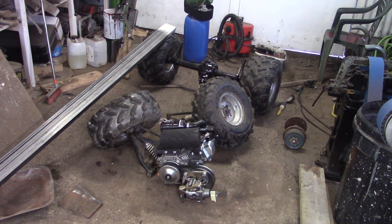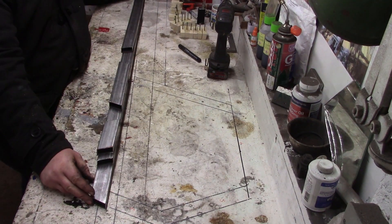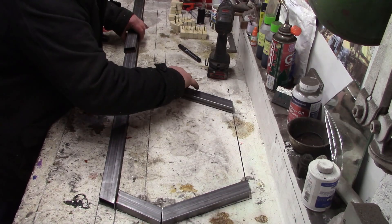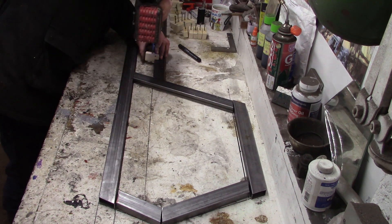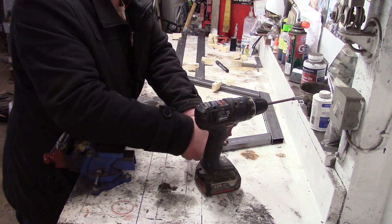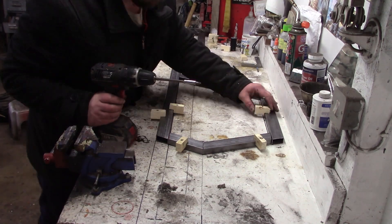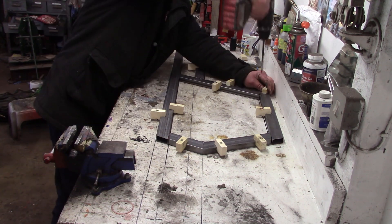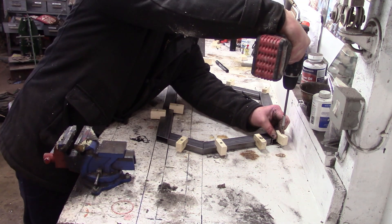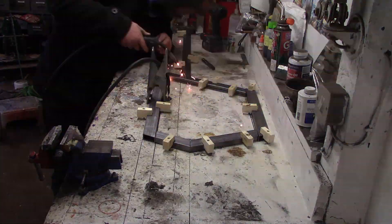Alright folks, let's build a chassis for this dump truck and join all these bits together. I've got some 40mm by 20mm electro-welded box section mild steel, 2mm wall thickness — reasonably heavy, not flimsy but not super heavy, affordable, that's the main thing. I've got everything laid out on the bench, angles cut, clamped down. I even did a little drawing on the bench so everything's in the right place, and I cut some wooden blocks and drilled them down to the bench before welding it up.